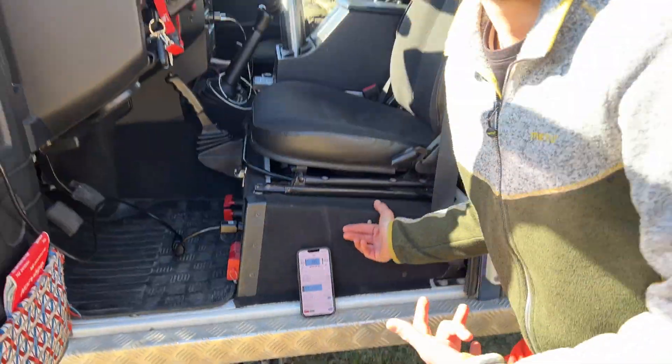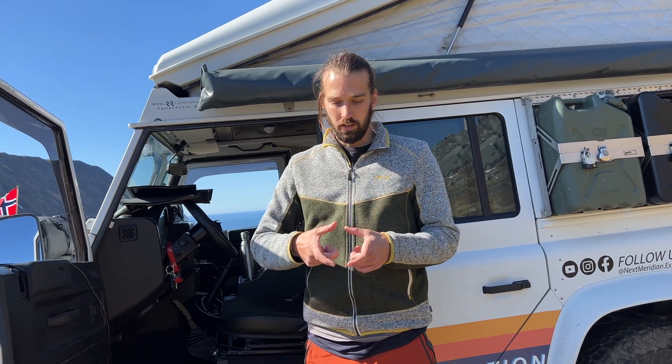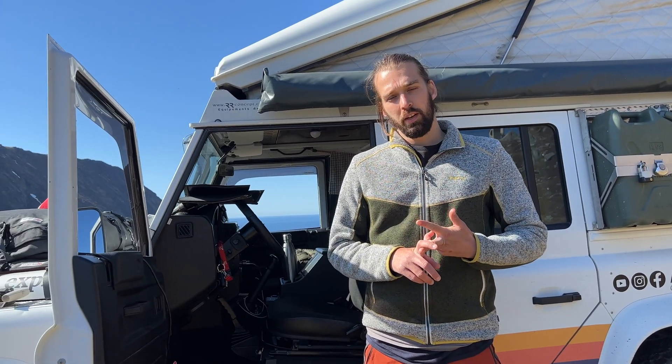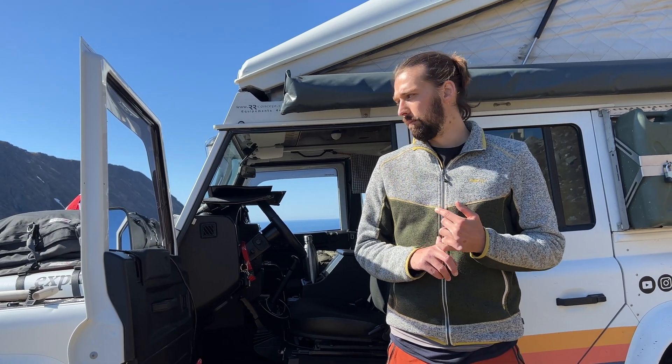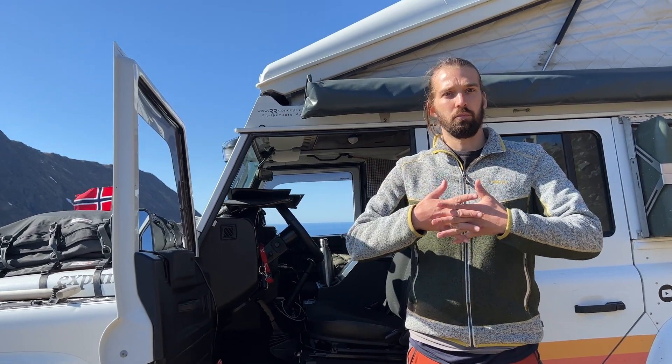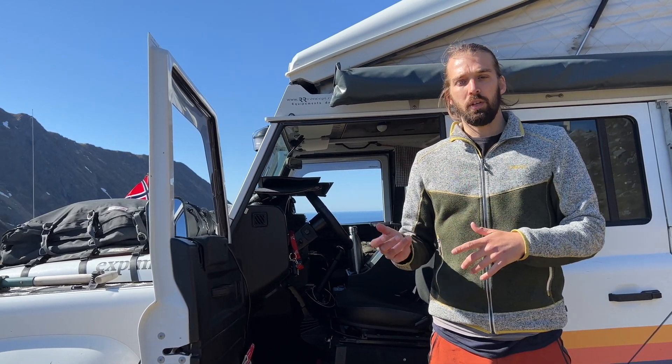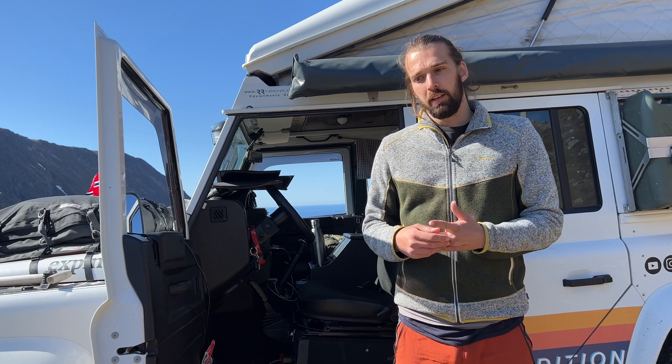These are the things you can do to improve your input from solar panels — this is true for any solar panel. If you're charging even a small carry-on panel in the sun, point it as much as possible toward the sun; it will really help with the charge. We were pulling about 80 watts with one iPad, one computer, and one drone battery, which is roughly our usual consumption plus the fridge. With one solar panel, that's enough to break even between discharge and charge. With the extra panel added, we go above that — so we could live on the road, if it's sunny, with just our two solar panels. Rainy days are a bit more difficult.